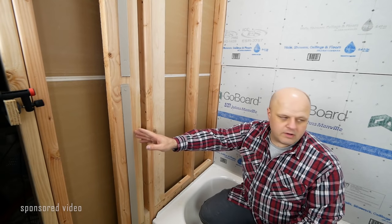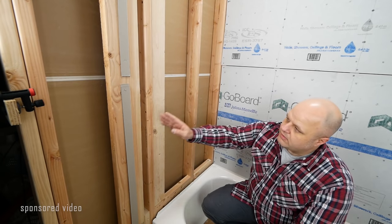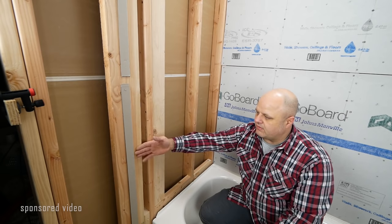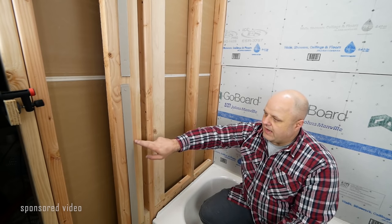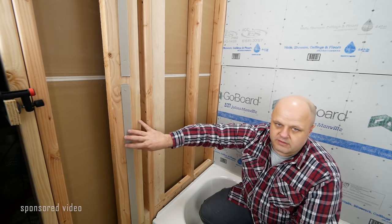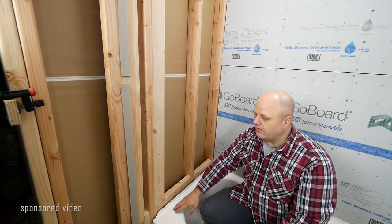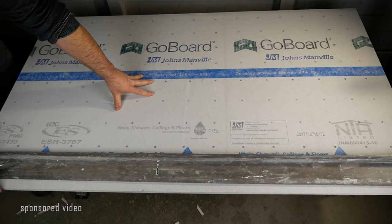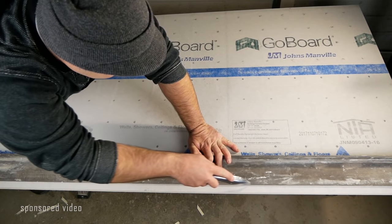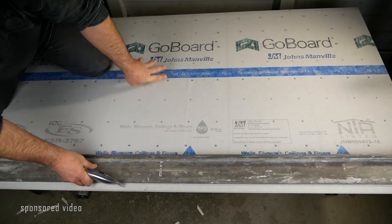For this wall I wanted to match the other wall, which went out to 35 and a quarter inches. So for this wall I'm going to bring it out to 35 and a quarter. With GoBoard and any backer board, you can't have the ends just end on nothing — you need some backing. I added a piece right here and the GoBoard will stop here, with drywall from here over. This gives it something solid to be secured to. You can't have that seam on nothing on the verticals.